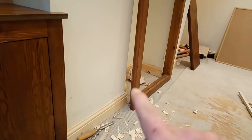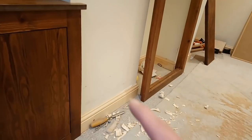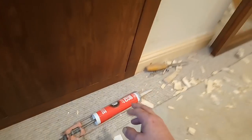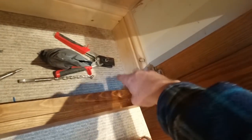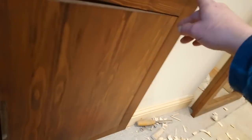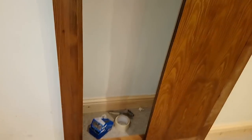I'm gonna fit that one and chop it in again like I did this one down here. Apparently she quite likes it now so it might be staying, so I don't even know if I fit the skirting up to it. It's a bit light now — not too happy that I've chopped so much away on that joint. So I'm gonna see if I can get some reinforcement in here, get a block in maybe. Plenty of glue — it's going to be held by the shelf, held by the top, and held at the bottom. It's not going to go anywhere.